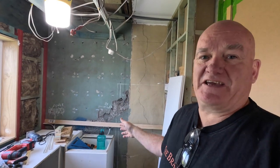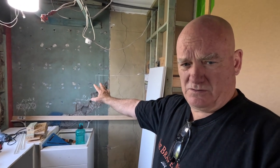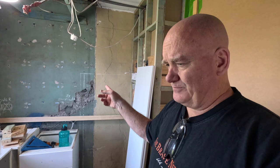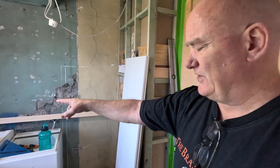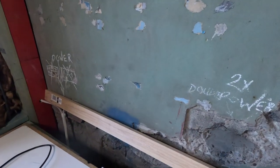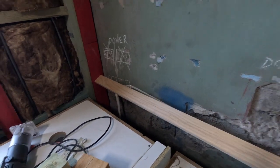This is like the next phase for me. I want to panel that wall where necessary, and then build the carcass around the fridge. Now, in paneling that wall, I know that the wall is out of square from the front wall by the thickness of that stud. So if I put a straight line on the wall in that corner, and then on the stud in this corner, that will make that wall square to that wall.